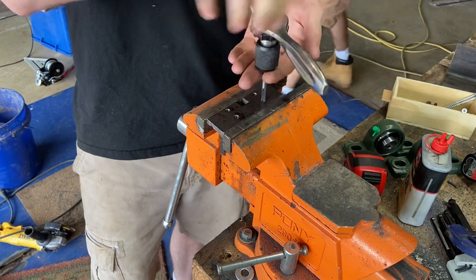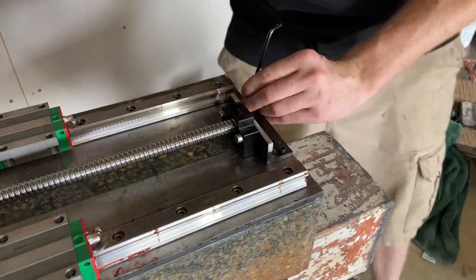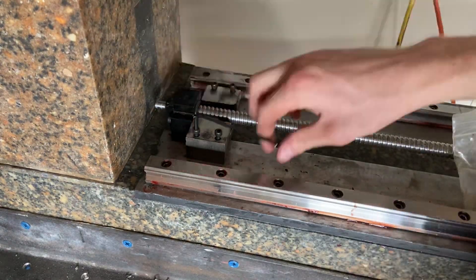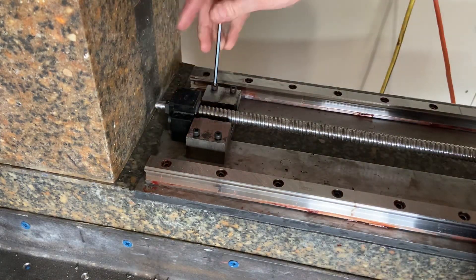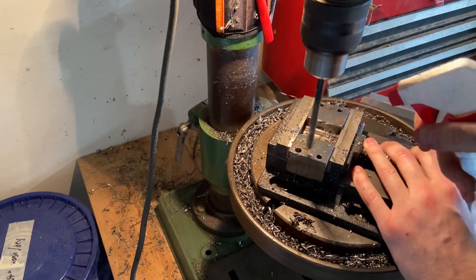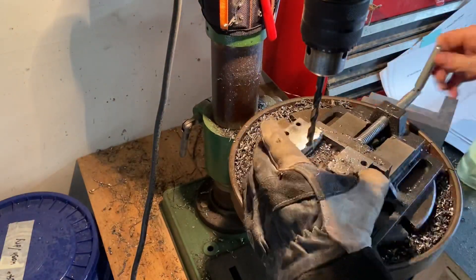If there's anybody else like me who didn't know this already, there's basically a strong side and a weak side to the lead screw. The strong side — at least that's what I'm calling it — has two tapered roller bearings or some other type of bearing that's going to resist axial force. The weak side basically doesn't take pretty much any force at all; it just holds the end vaguely in place, and the bearing on that side can actually slide axially forward and back, so that way if the ball screw expands with heat it can relieve some of that pressure.